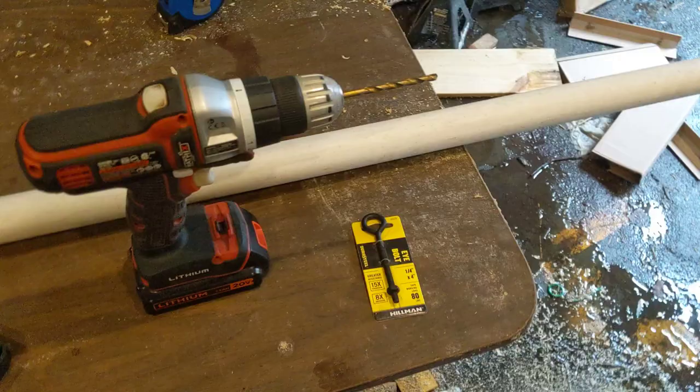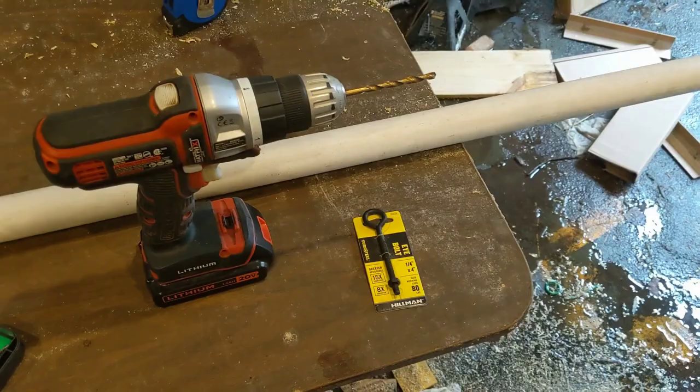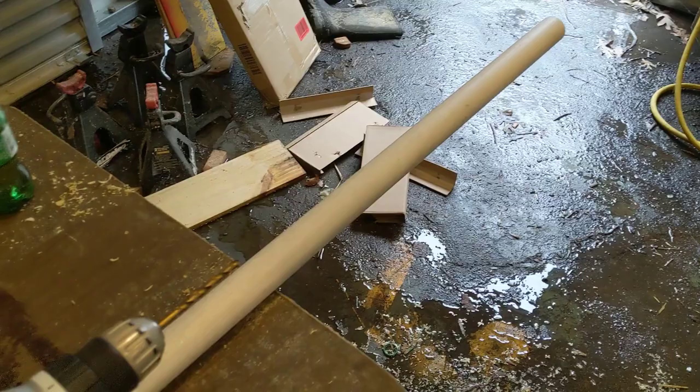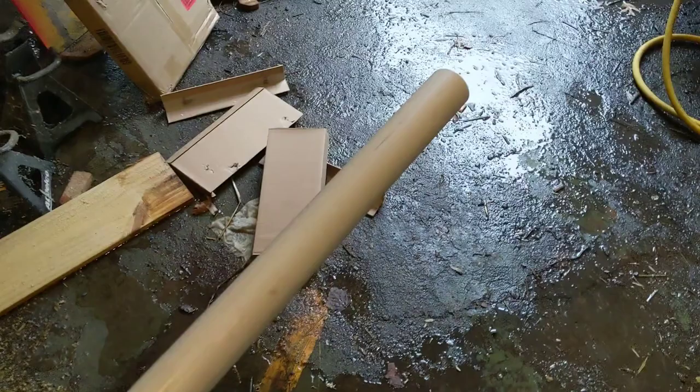This is the way I had them stored and I don't really need to take them apart. About five or six inches from the top of the PVC rail, I've slid the metal out of the way so I won't be drilling through metal. We're going to drill a hole to attach an eye bolt — this is what the paracord will run through and how you'll tension the antenna. The eye bolt is now attached.